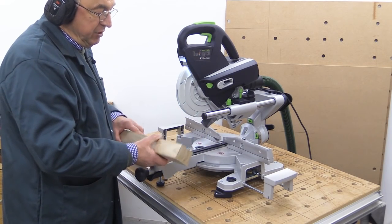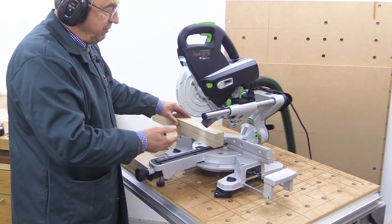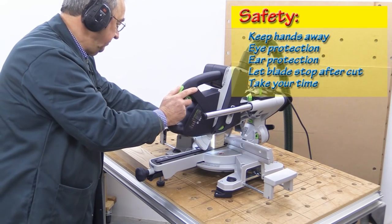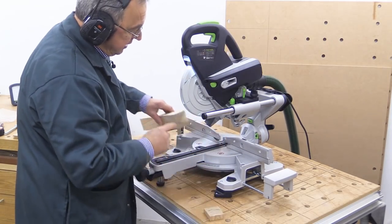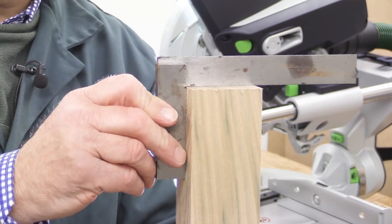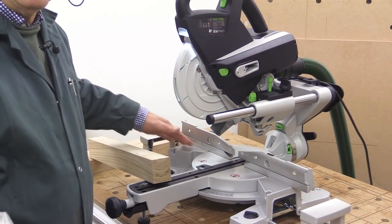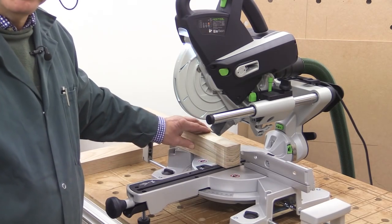I'm going to start with a piece of ash. This is 60 millimetres deep, which is theoretically the maximum depth of cut of the saw. I actually believe the saw can cut a little bit deeper than that. My piece just cut through very nicely and cleanly. The first thing I'm going to check is how square it is — that cut is absolutely perfect both ways. And frankly, that just goes to show that putting a straight edge across here isn't the way to really judge it. Do a cut and see how good the cut is.